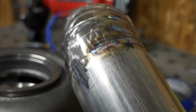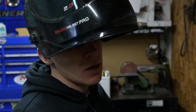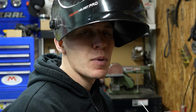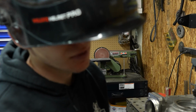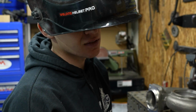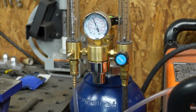Damn, son. Hey, we're getting somewhere, son. I'm learning how to kind of pulse the foot pedal as I dip the filler rod, and it's making my dimes a little more consistent. And I turned the gas up to like 30 CFH, and then I'm back purging with about 7 to 10 CFH. So it's looking a lot better. Getting somewhere.